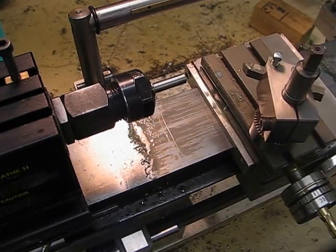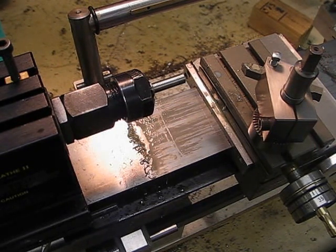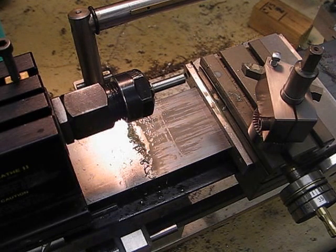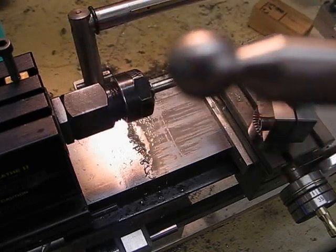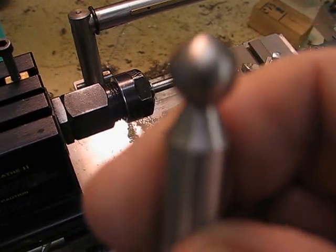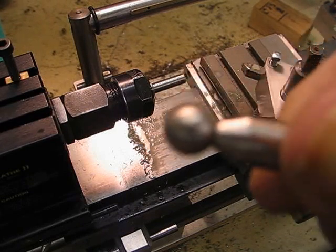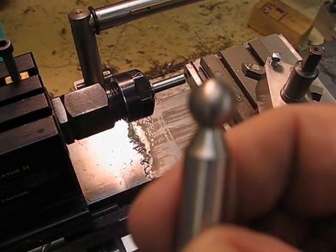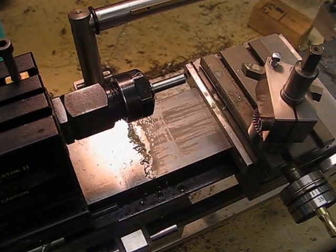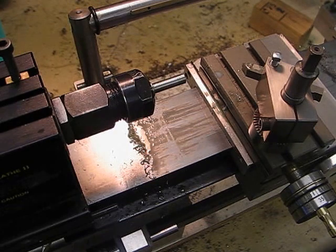I've also bought a small piece of 3/16" cobalt that I used on the ball turning tool I use to turn these balls up. They came out quite nice. I find the cobalt stands up better and there's less grinding — it lasts longer. I'm sure there's lots of information on cobalt on the internet, but I just thought I'd show you.